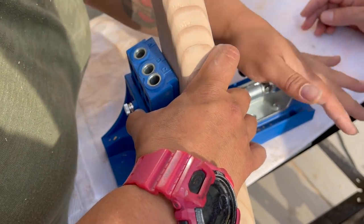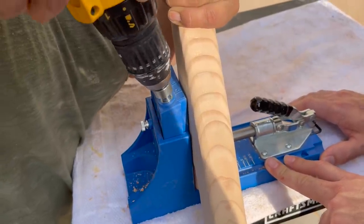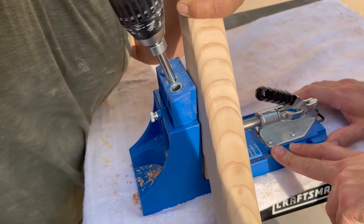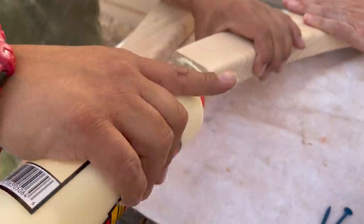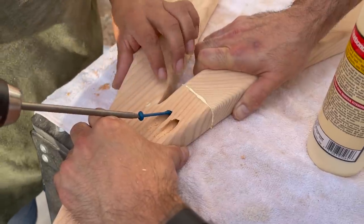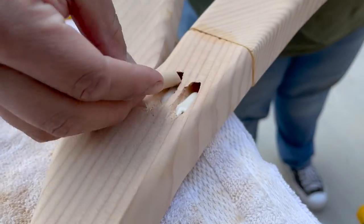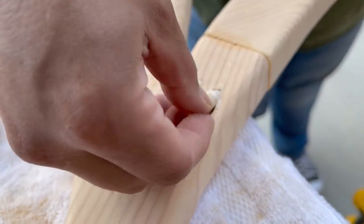To attach my pieces together I used my Kreg jig and the help of my husband. This is kind of an odd shaped piece, and being that it was Douglas fir I didn't want to clamp it any more than I had to, because being a soft wood it would probably dent pretty easily. Before I attached my pieces with screws I added a little bit of wood glue to add some extra strength and to make this joint seamless. Just had my husband hold it into place and I drove those screws right through. I love this Kreg jig. To fill in those holes I put a little bit of wood glue and used the Kreg jig plugs — I like to roll the plugs in the glue first before I pack them in, it gives a really nice tight seal.